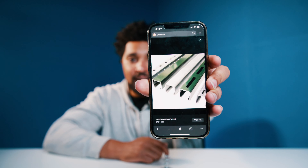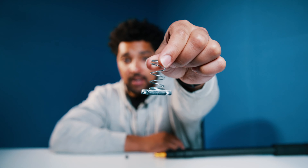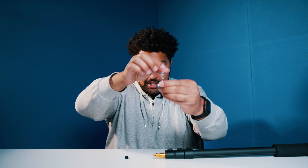Another thing we've had to think about is how we're going to fit the lights to the ceiling. We'll be using Unistrut, which is actually getting spray painted black now. We're having it spray painted to match the classic colour of the studio, putting it on the ceiling, and then we'll be using a few things to connect our lights to it. One technique is using this boom pole, and one way to connect it to the ceiling is using this — an orbital fastener. Imagine the Unistrut hanging off the ceiling with two hooks — this is going to drop into those hooks and the spring gives it pressure to hold it in place.